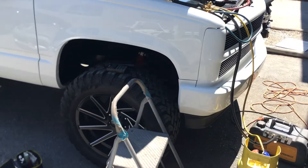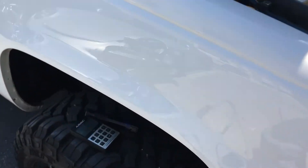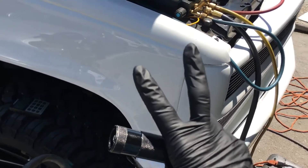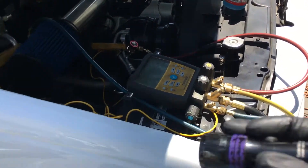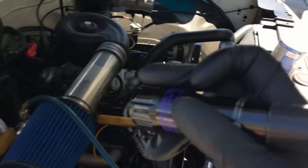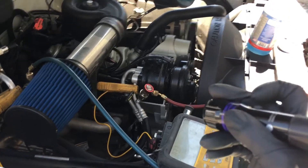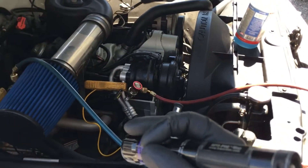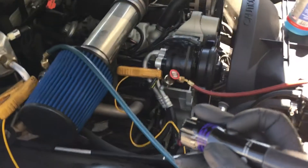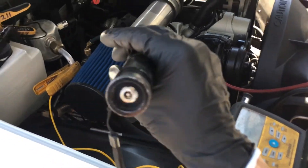I put some gas back in because I knew this would have a huge leak under vacuum. We are now in video number two — I purged out the dry nitrogen. When the nitrogen was coming out, it smelled like rancid, foul water, like decayed old vegetable oil left under a cabinet sink for a long time, or water that had food left in it under a plastic cover for a month. This is what the air smelled like coming out — this system is so moisture contaminated.